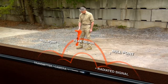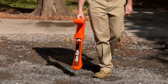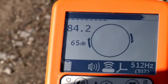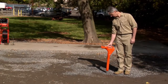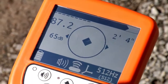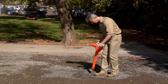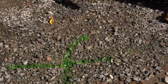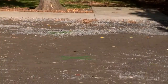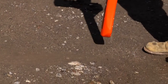The transmitter is always located exactly between the two null points. Move the Hotspot locator between the null points. The line location compass will tell you the lay of the pipe. Arrows around the outside of the circle tell you which way to rotate the locator blade until you are in line with the pipe. Arrows in the circle will tell you which way to go. When you're over the camera, a diamond in the center of the circle will mark the spot. The depth of the camera will automatically appear as well. Once you've located the camera, mark the ground with green paint or a flag. Push the camera ahead another 10 to 20 feet and repeat the location process. Mark the spot of each location. When you are done, you will have successfully and easily traced the length of the pipe all the way to the trouble spot you were seeking.